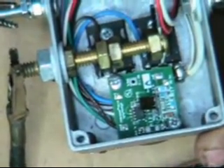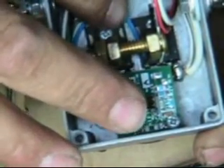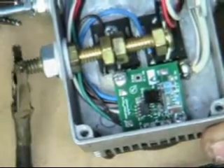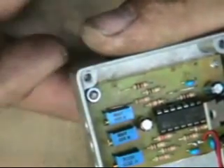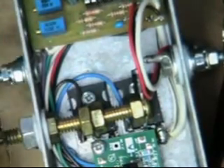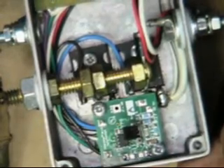There you go guys — this little board right here makes these MOSFETs run quite cool. This has a little fan on the bottom. It cools my capacitors over here that I was telling you about. I can't flip it over because I've got alligator clips hanging on it, but the capacitors are mounted underneath like I showed on the second video. The fan blows cool air around everything down here, keeps it outside of the box, keeps the box cooler when you get it closed up. There's no ventilation in it, so the MOSFETs will warm it up in there pretty good.